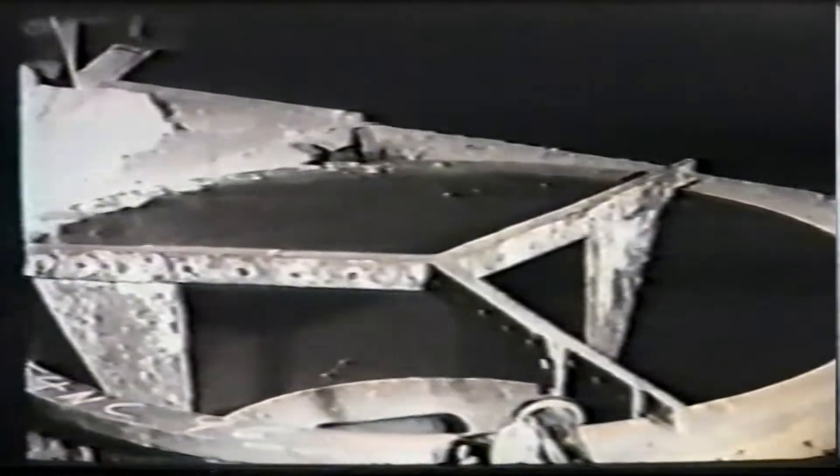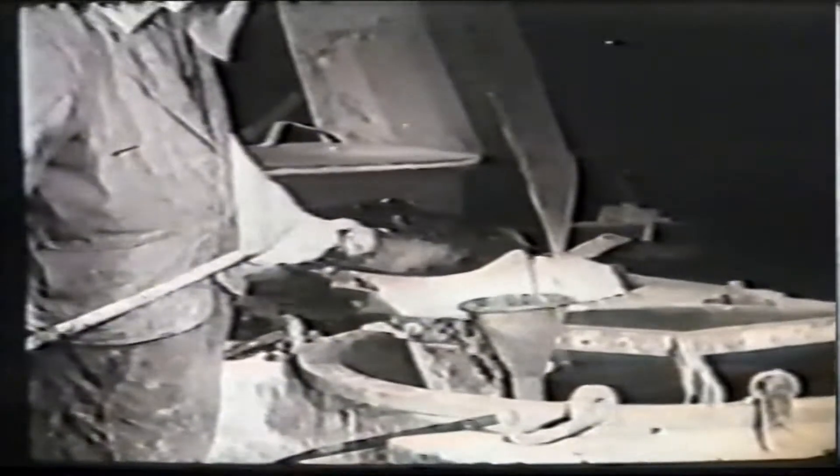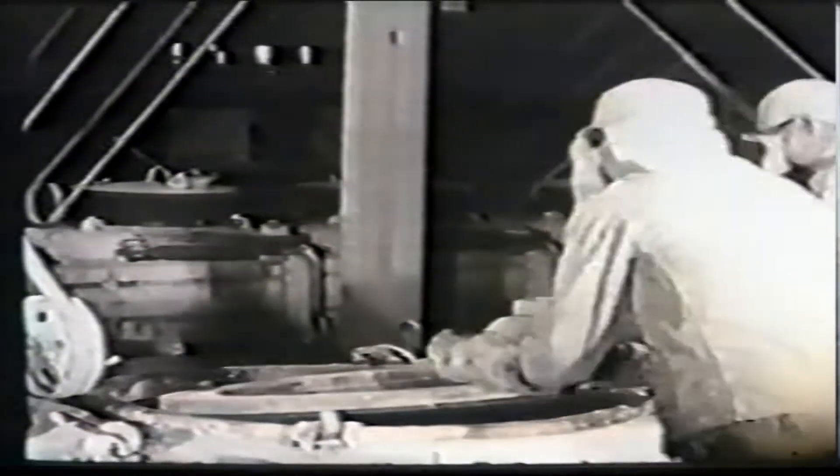While the cathode is held by the jig, electrolyte is poured molten into the cold pot and allowed to solidify. The jig is then removed, and the cathode stem connected to the copper bus bars. Next stage in the assembly is the fitting of the top ring, to be used as a support for the nickel anode, being insulated from it by asbestos pads.